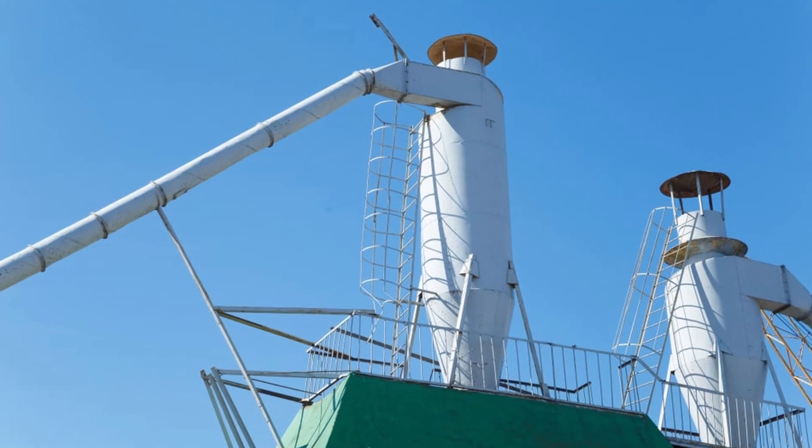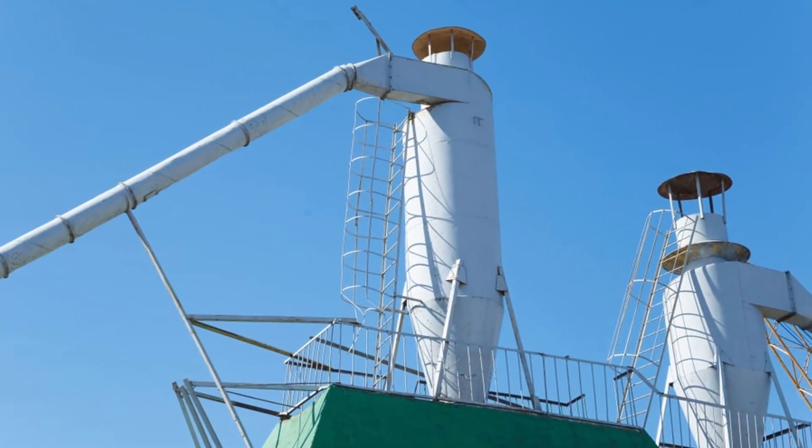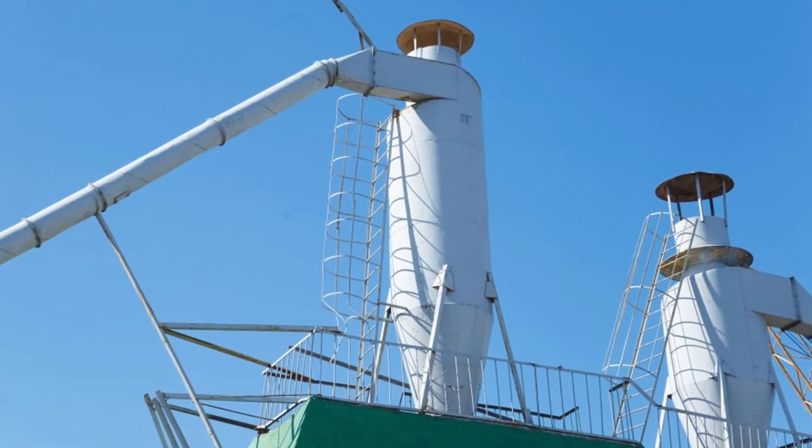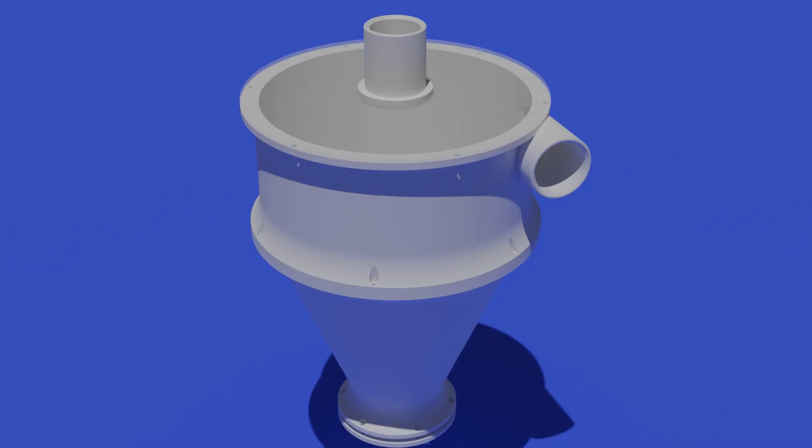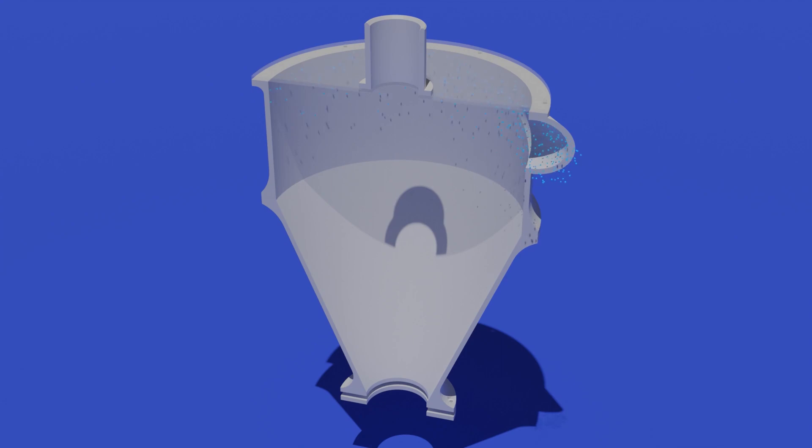Now I'm certainly not the first to use something like this. They have long been used in industrial applications due to their ability to filter out dust and other particles while requiring almost no maintenance. The way they work is relatively simple. They have an inlet into which the dirty air enters. Due to their geometric shape, the airflow begins to form a vortex, similar to a mini tornado.